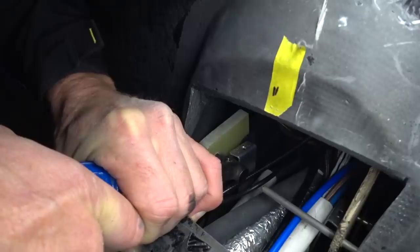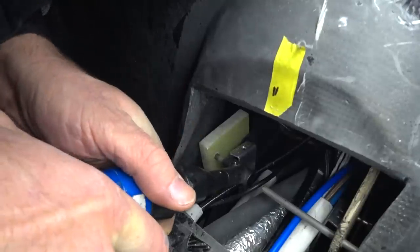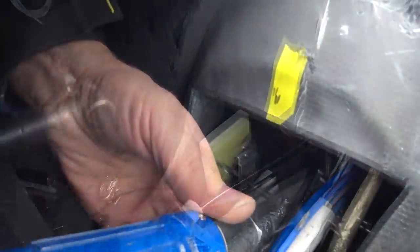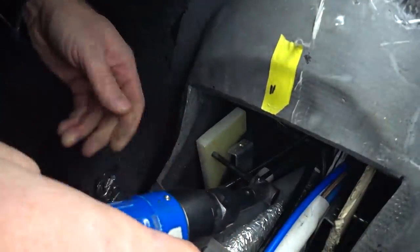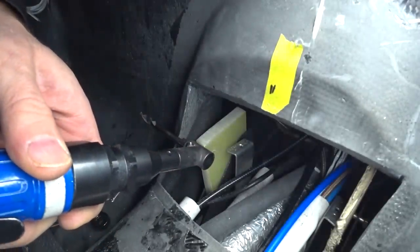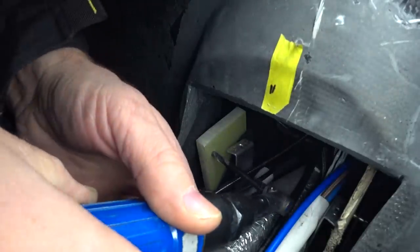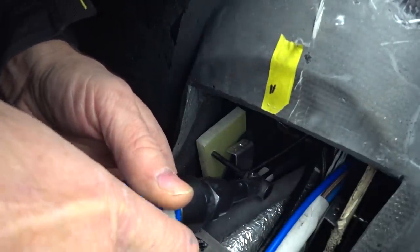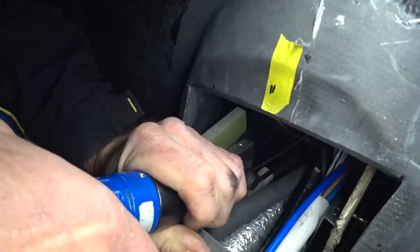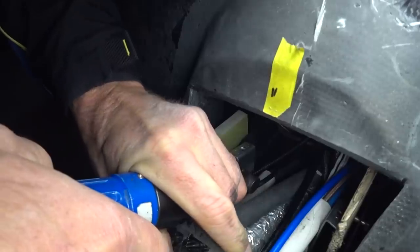It was quite a lot of carbon to drill through, and there's sort of a cavity in behind there where there is some foam, or at least it felt like that — and from memory I think that's what the case was. So I'm taking out the medium sized bit and putting the longer one in so I can get all the way through. Now that the holes are in there, I don't really need that other rod to help align everything. Just checking to make sure I've got enough length to get all the way through, which I did. So the next step was to enlarge it out to half inch from the quarter inch.